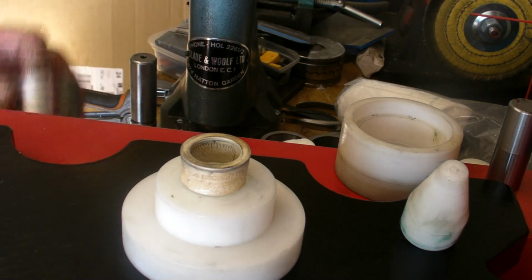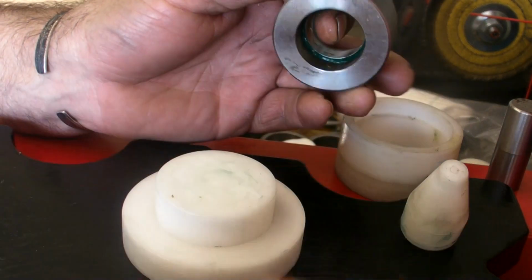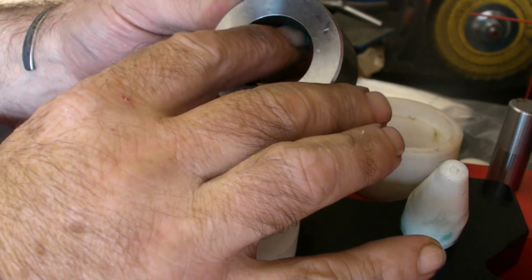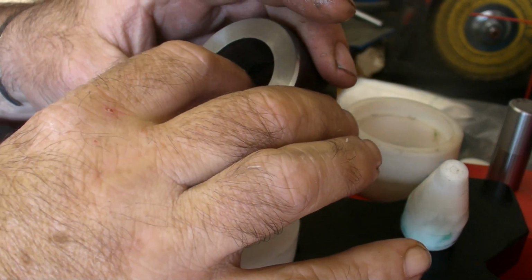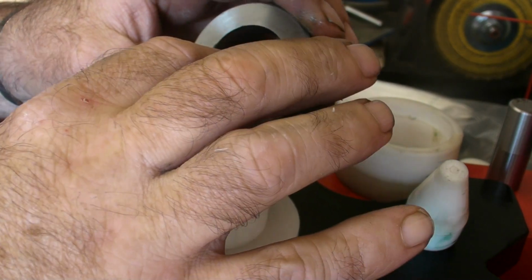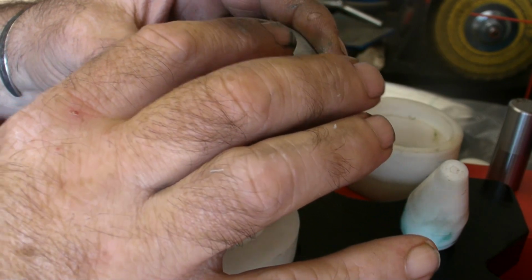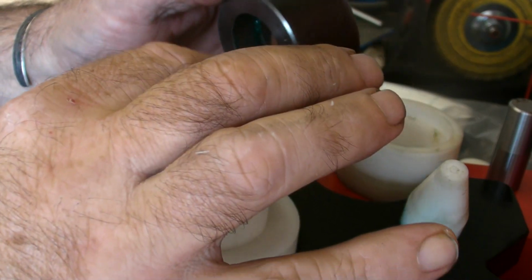But as I explained to you before, where's that die? This one will do, it's the same design. Now you don't need all this clearance here, that's just for my benefit. But you need to make sure when you push down an SW and you're pushing through, for starters, try and get the size of ring you want, because when you do push out, you're going to alter the shape of that ring. And if you need to readjust it in another die, it's not going to. You want to keep it die size till you're ready to bring it out.